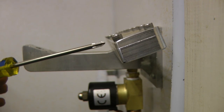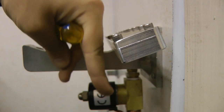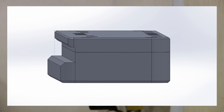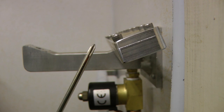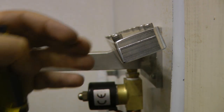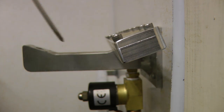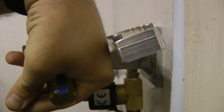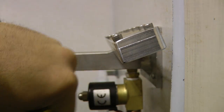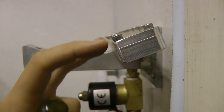Initially the nozzles on the end had some little protrusions to attempt to stop your skin from getting too close to the compressed air nozzle. You can see a picture of that based on the original 3D model. But I found that the air coming out of the jet would tend to stick to those protrusions, and the air jet would basically either go straight down or straight up. So I ended up having to just machine those off. I would like to put some sort of protection there — it's not a great idea to get your skin very close to an air jet. If you have a little cut or something, the air can get under your skin. So I'm thinking some sort of wire mesh screen to cover it up.